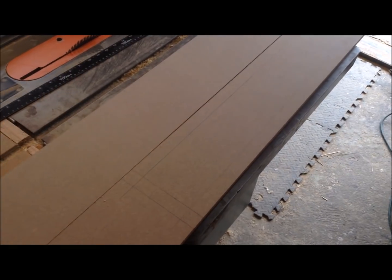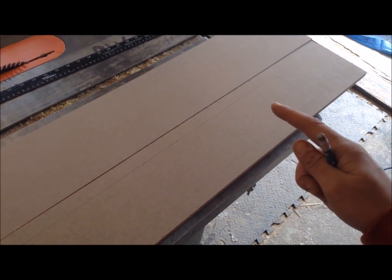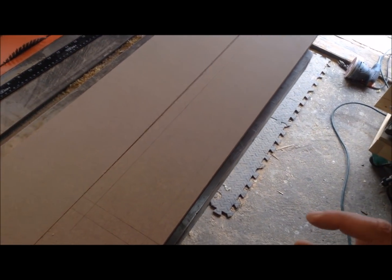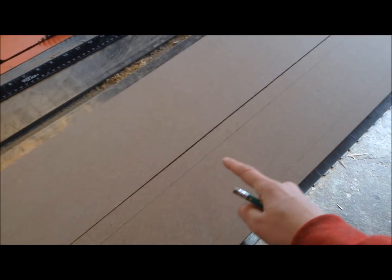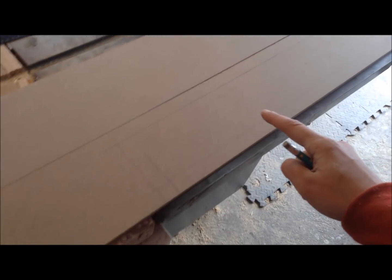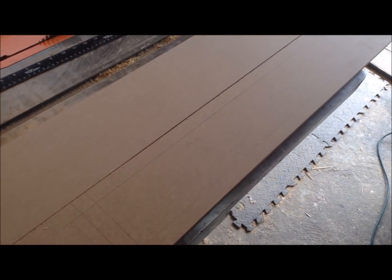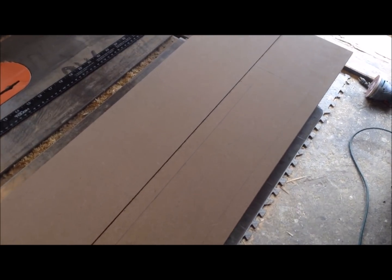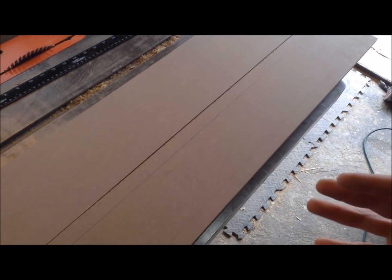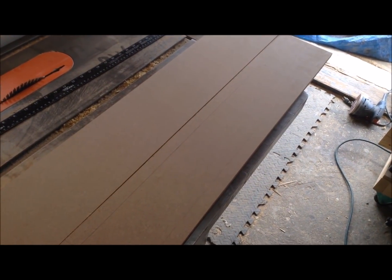So I'm working on the plinths right now, and there's going to be a recessed piece in the middle of both of the legs, and that recessed piece is 1/2 inch. So I'm going to be cutting this rectangle based on the dimensions out of the center of this piece of MDF. This is 1/2 inch MDF, so then I'll have my exact recessed depth, and I could glue this to another substrate, and then all the joints on this are going to be mitered, and then miter that substrate.